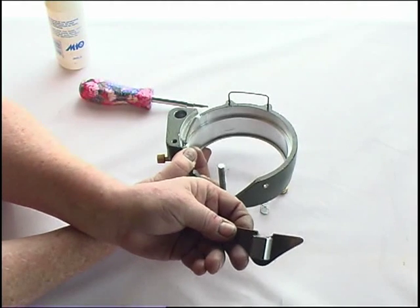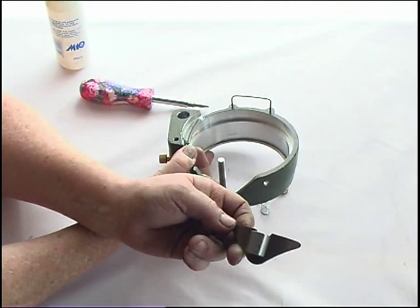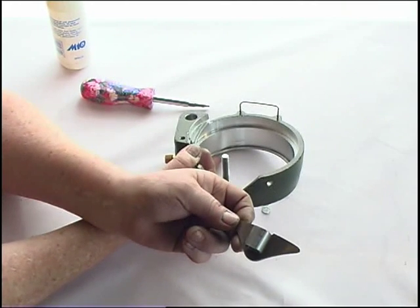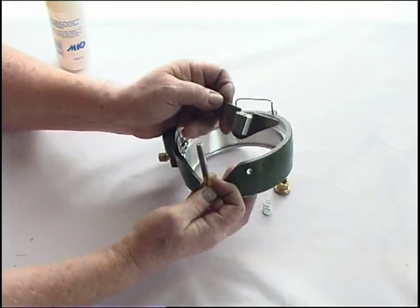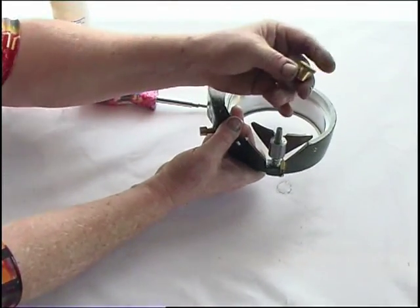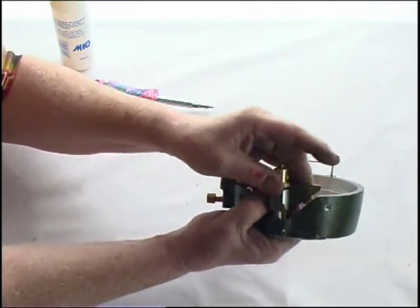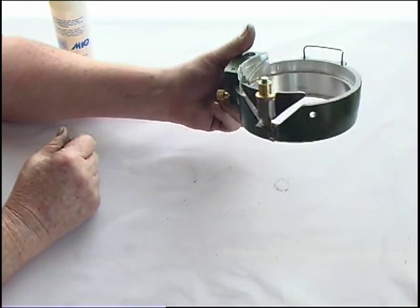We now take our stitch cam. This stitch cam is made for up to a 70, up to an 80-slot cylinder — 84-slot is okay. Any higher number cylinders, you will need one of the shallower stitch cams. We'll also be making very shortly a stitch cam for 48-slot and 54-slot cylinders, so those will be available very shortly. It can also be used for 60. Spring first, then the v-cam, and then our knob facing down, and just screw it down about halfway. Apart from putting in the side cams, which we'll do when we finally assemble the machine, that's our cam shell all complete.